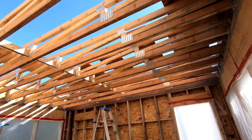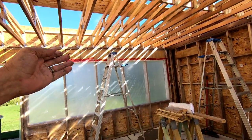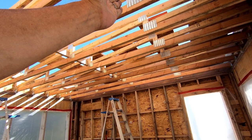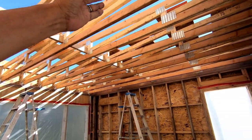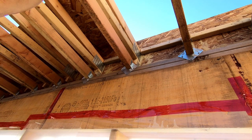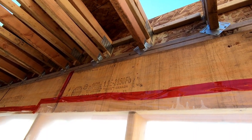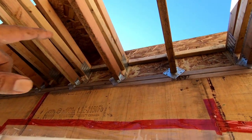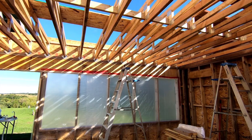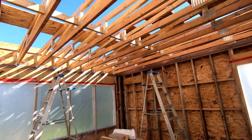So what I'm going to do is start putting the damn roof on, and I'm going to try putting plastic over it. I'm going to work from the high end down. That way, if I got one row open, I can plastic it real easy and the water will drain real easy. Once I get all the way up to the end, the water will go over the edge, and it might puddle there on those cleats and get the wood extra wet. This needs to be pretty dry when I put the rubber membrane on, so I want to keep it as dry as possible.